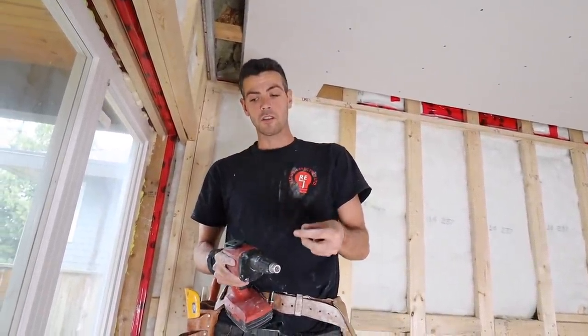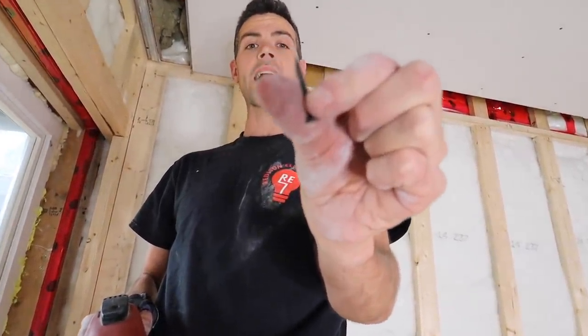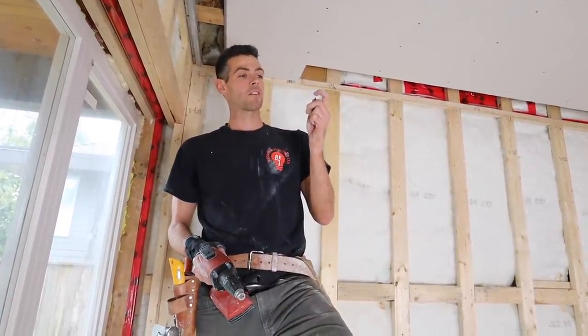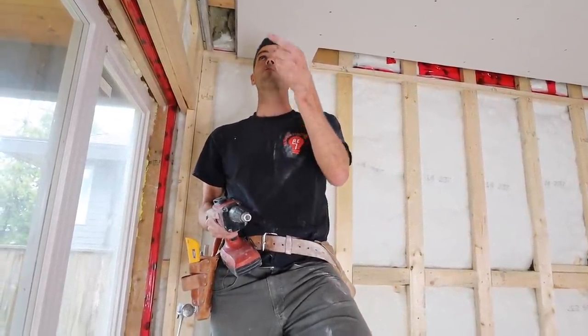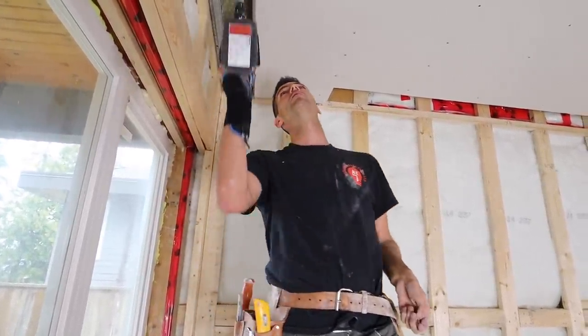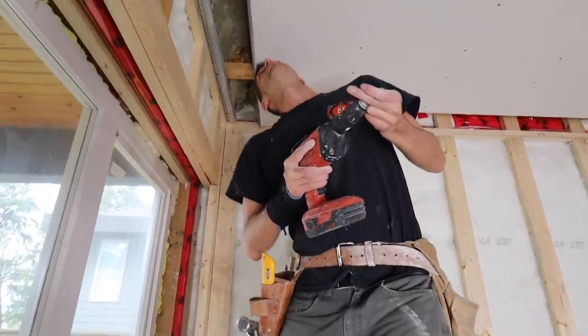And the screws you use can matter a lot. These are good quality screws from an actual drywall supply. You get the cheap fine thread Home Depot screws, those things suck. They're rounded over on the tips. They don't hurt your fingers as much when you're digging in the bag, but when you want these to bite really quickly into steel stud, get the real screws. Otherwise, they just don't work quite right.